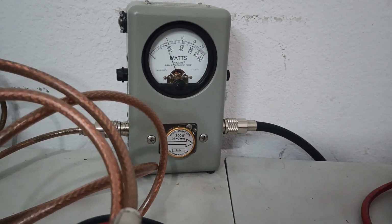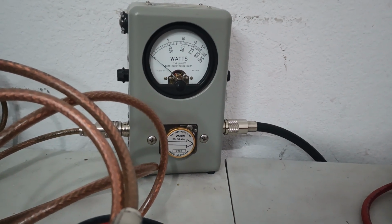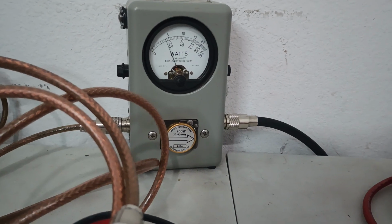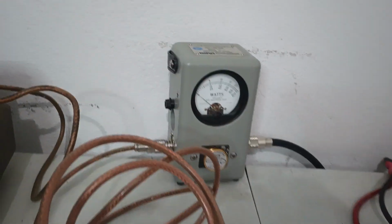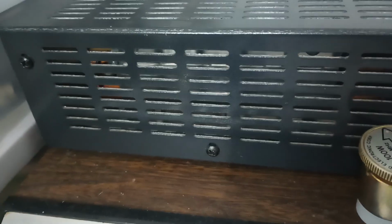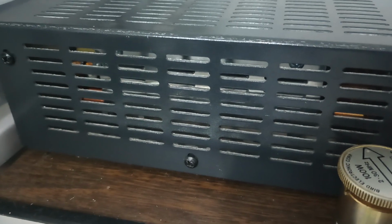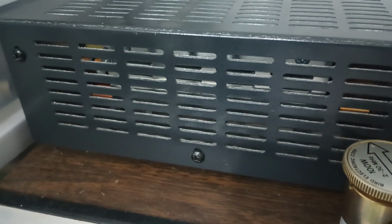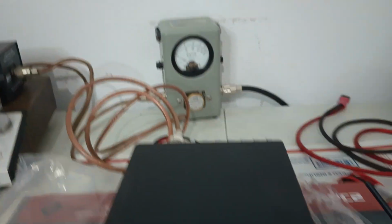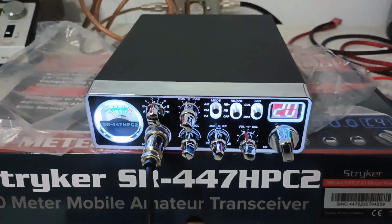Hello, audio. So 50 average on audio. Whistling 60. And we've just got our mic gain at about 1 o'clock here. If you guys want to hear it through this radio: audio check, 1, 2, 3. Excuse the feedback. Radio check, radio check. So sounds nice and clean, loud. That's with a Superstar DM507 and the mic gain at 12 o'clock, 1 o'clock there. So doing a real good job.